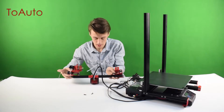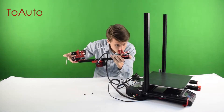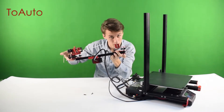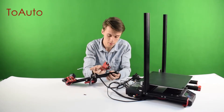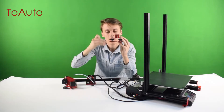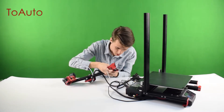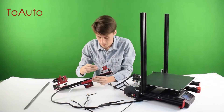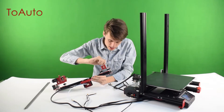After it's placed in that hole, you have these two holes on this end and this end of the bracket — see where my thumb is? You're going to line it up with the first hole and the fifth hole on the X-axis guide. Once you have those lined up, place the screws in these little holes right here — it can be a little difficult to get in there. Line them up with those holes and place it right on. Then tighten the screws. Make sure the screws on the XZ connection bracket without the motor are nice and tight — both of them.